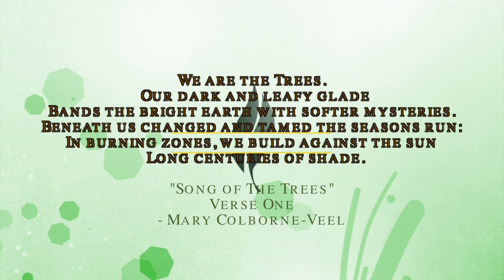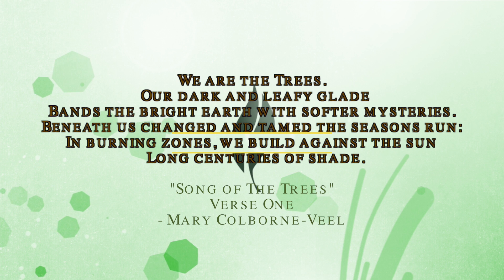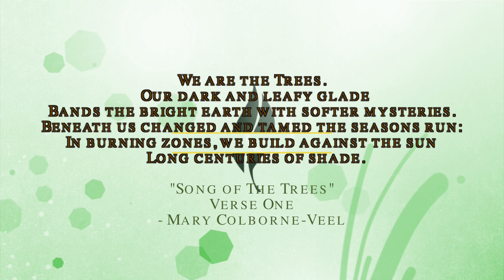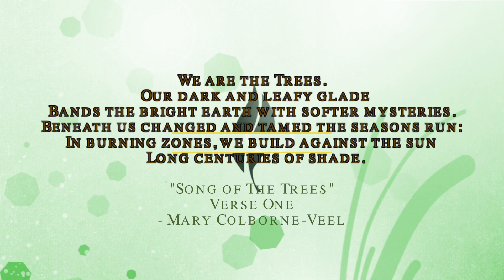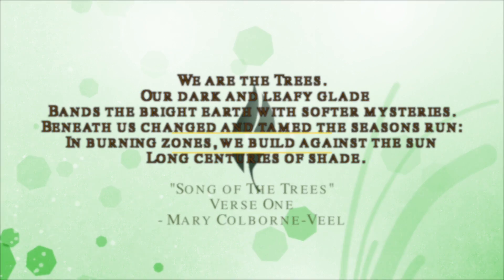Meg is hoping to get the Village Board to pass, in their zoning ordinance, laws that say when sidewalks are replaced, structural soil is put underneath — which allows tree roots to move through those spaces without lifting the sidewalk. The reason trees lift the sidewalk is because they can't get enough oxygen underneath the impervious surface. If they have a space to move through to reach a lawn on the other side, they will. She hopes all future sidewalks will be underlaid with structural soil instead of just regular gravel.